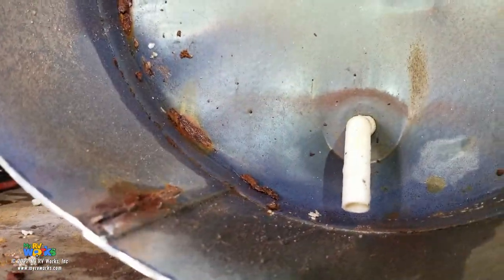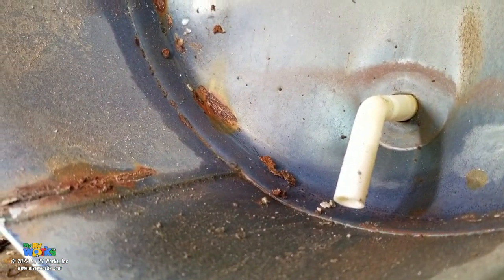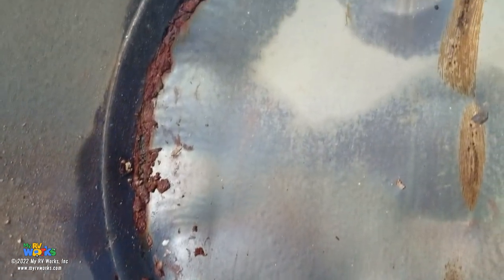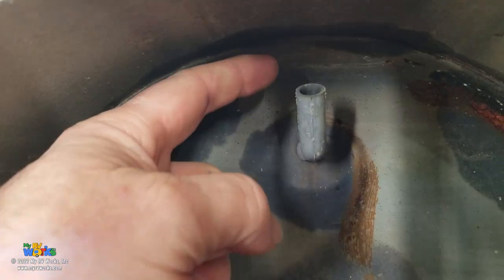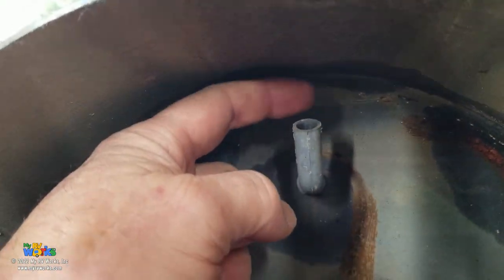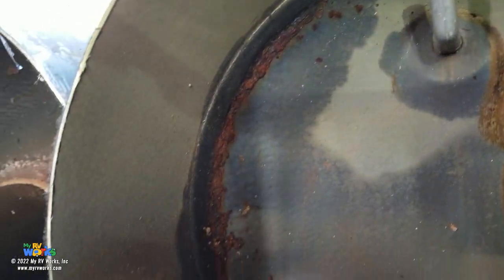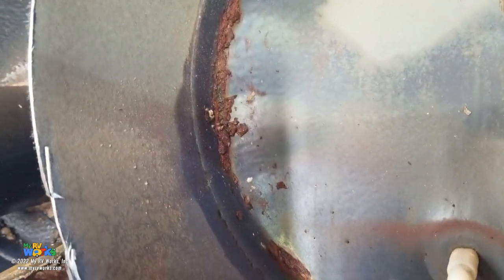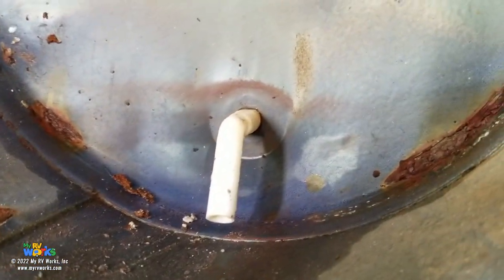So there you can see where the cold water comes in. You see a couple rust spots along there. And then if we pan up, it draws the hot water off the top. And then that little buffer between the top of the tank and here, there's your little pillow of air that it's looking for, okay? And I was expecting to see more rust on the bottom, but we've got it all along that back seam there, okay?